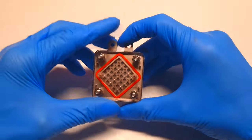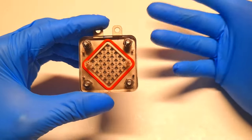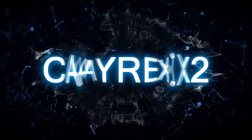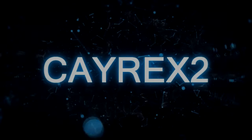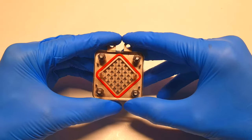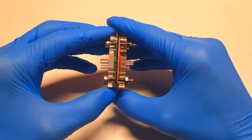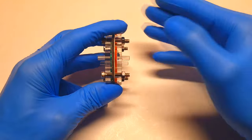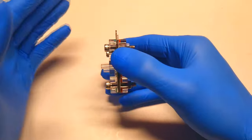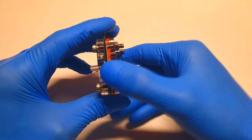Here I have another hydrogen fuel cell, and this fuel cell I will convert into a hydrogen metal battery. The hydrogen metal battery is a hybrid device between a battery and a fuel cell, which means the negative side is made from a fuel cell and the positive side is made from a battery. The negative active material is hydrogen and the positive active material is in most cases some metal oxide material.